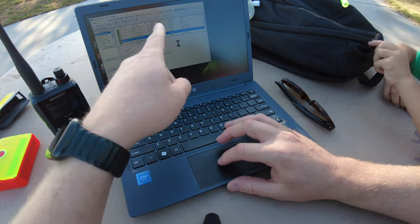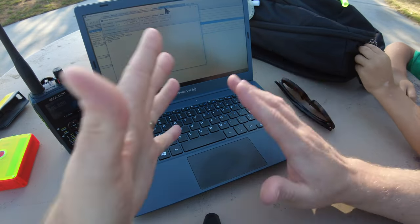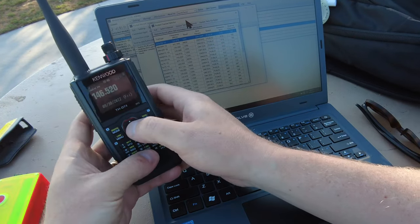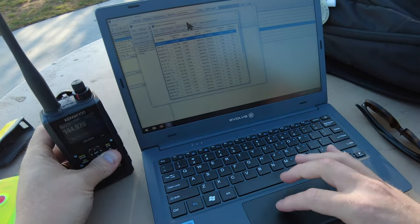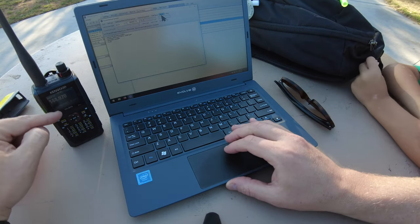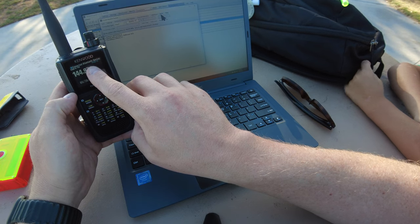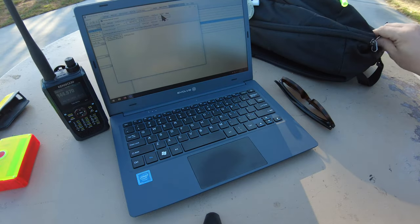So we're gonna run Winlink and we're gonna start a packet session, Winlink packet. We're doing this real time. You're seeing me do this all in one shot. We're gonna do channel selection. Likely this guy is the closest one to me. He's 15 kilometers, so we're gonna go enter 144.970. Stock antenna. We may have to change the antenna, but let's give it a shot. And we should see this. Give it a go here. Connected Bluetooth. Transmit. No connection. We're gonna need to get that antenna out.